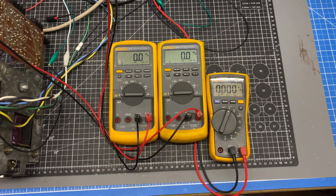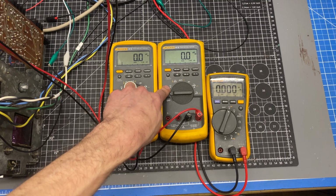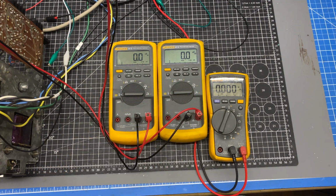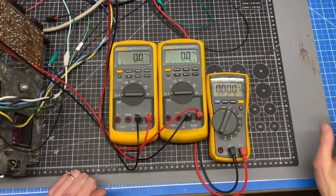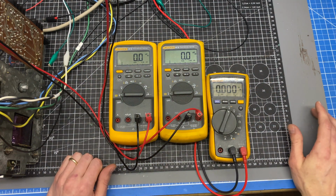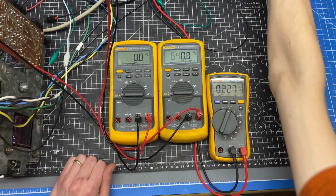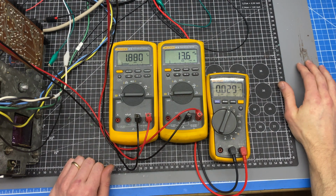The way that I have these meters set up is they're tied across the tweeter load, woofer load, and mid load. So I'm going to sit down here, and we're going to feed the signal. I'm not going to move the camera so we stay on the meters, and I'll just describe what's going on in the signal generator. I have the frequency set to 15 kilohertz. Let me power on the amp. Okay, so frequency is at 15 kilohertz and amplitude is at 100 millivolts RMS.